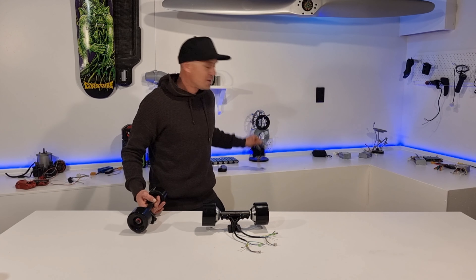Mounting the BMS wires, I like to do all the odds first and then all the evens second, so I'm not flipping the battery over multiple times. So I'll go 2, 4, 6, 8, 10 — followed by 1, 3, 5, 7, and 9. We've got a plastic substrate here, scored the bottom edges, folded up the sides, and we're using a little more fish paper just for insulation around the edges. We'll hot glue down the BMS up to the front, then coil up all our wires on the top and hot glue them nice and tight. We've measured the battery box quite tight, so hopefully everything fits. Then just get one more layer of fish paper on there — I do love my fish paper.